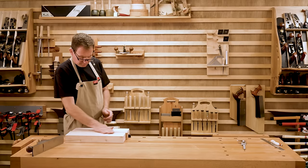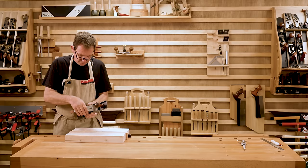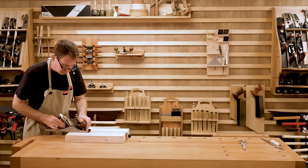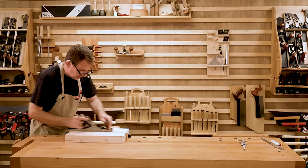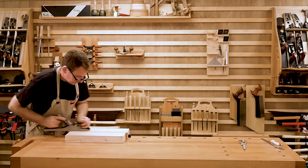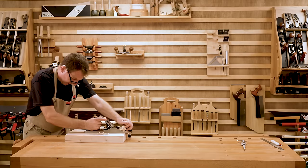Bring that in. All right. So we're going to get our plane. We're going to skim this very lightly is my aim. So let's see what we got. A little bit heavy. We're going to put things up and down. Okay. That's good. I can gently come up now. So I'll deliberately round the blade just back in. Gently coming up. Just starting to get something there. And I don't want a lot. Nice, fine. I'm actually just cleaning up the surface, if you like. Grubby fingertip marks. And really, that glue.